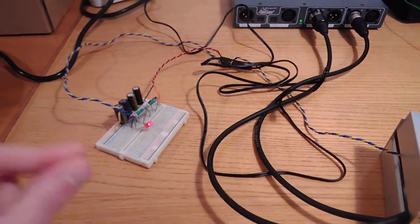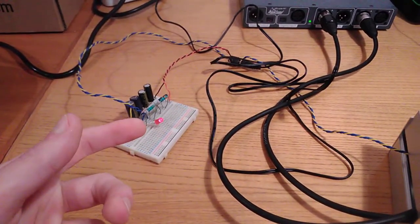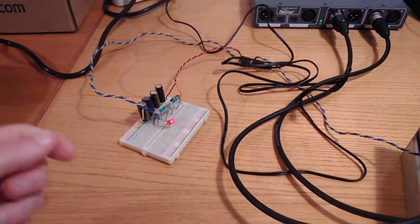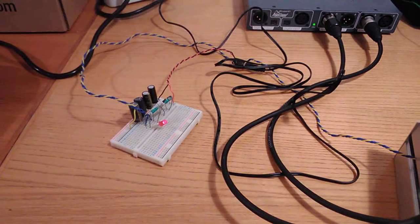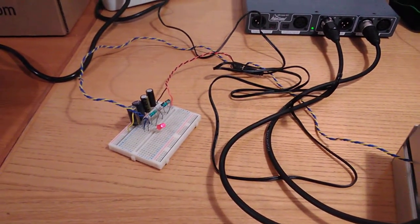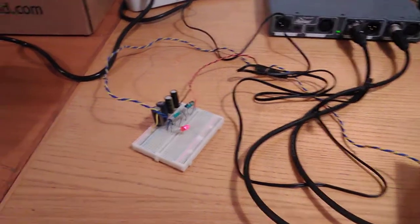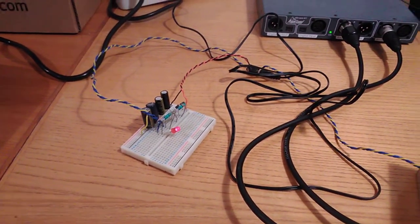That adds up. And also the muting circuit, because of course when you're switching your preamplifier on and off, you need to add a muting circuit to stop those unpleasant thumps and bangs coming through the loudspeaker as it switches on. And that means a few transistors, a few resistors, and an expensive relay, which is something that we don't want for an economical single stage design.